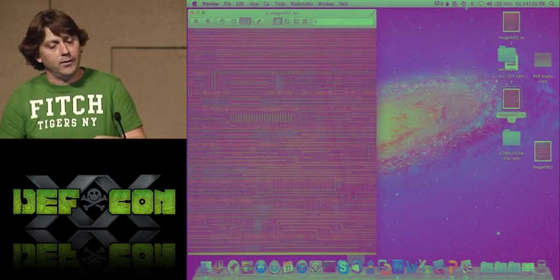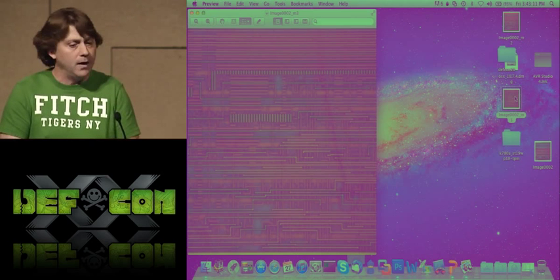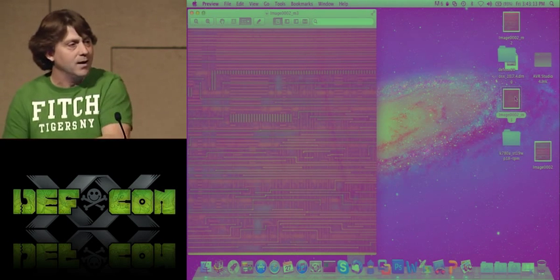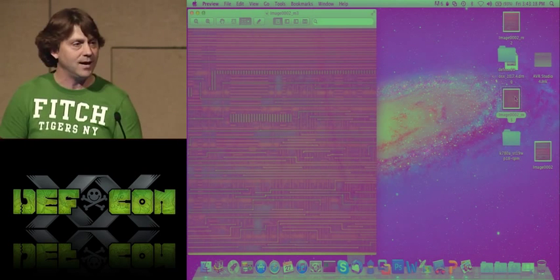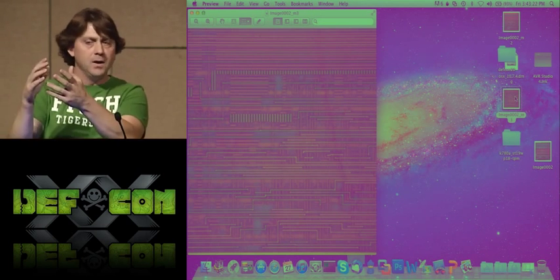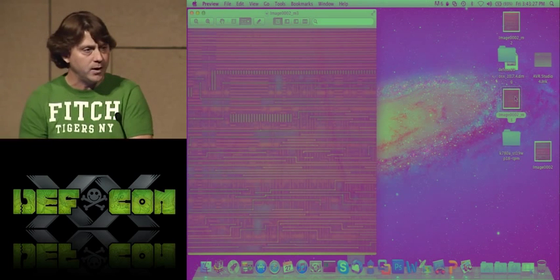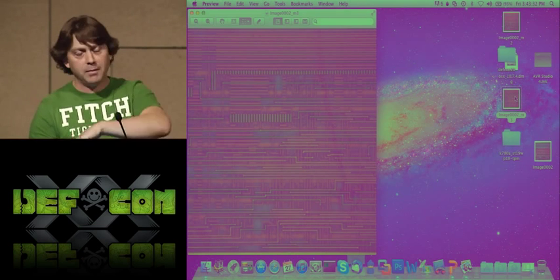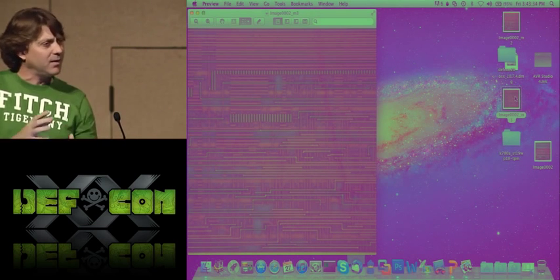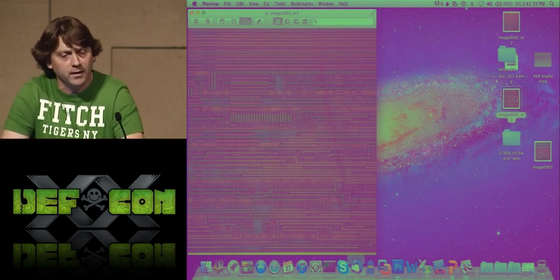You cannot latch something into a flip-flop to hold it for being decrypted, and then latch again, because now you've created a 2-clock penalty. That means the CPU would be crawling on its knees to execute. So from the output stage of the ROM or the flash, wherever it boots from, it's going to trickle through some combinatorial logic, propagate down, and then the first flip-flop you hit, it's either a key holding register for maybe a cipher feedback chaining or cipher block chaining type thing, or it's the instruction register. But it can't be anything else.